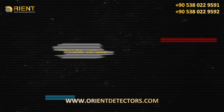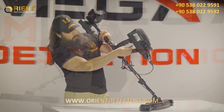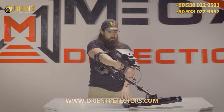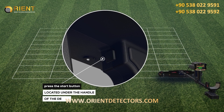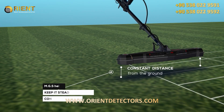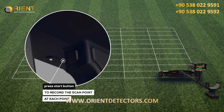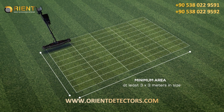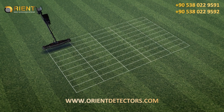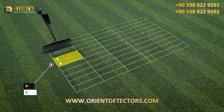How to use: after setup is complete, make sure the device is fully and correctly assembled. Hold the device fixed to your body without moving, then stand on the zero or starting point in the scanning area and press the start button located under the handle. Keep the MGS height steady while scanning at approximately a constant distance from the ground. In manual mode, record each scan point by pressing the start button before moving to the next. The minimum scan area must be at least three by three meters, with preferred dimensions of three by three, six by six, or nine by nine meters, with a thirty centimeter distance between each scan point.